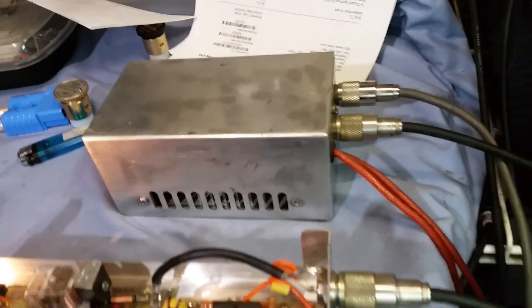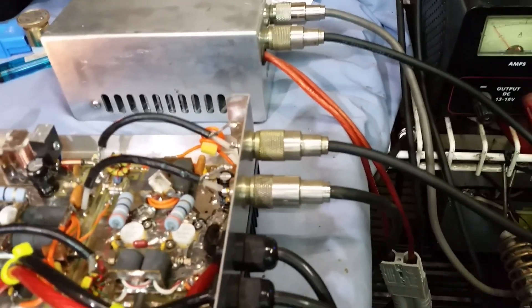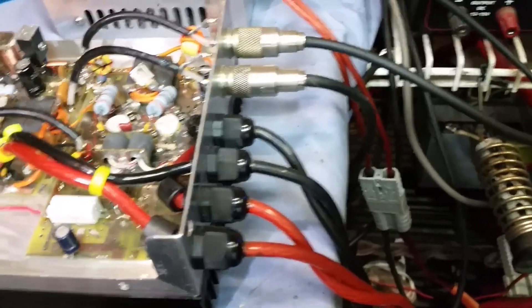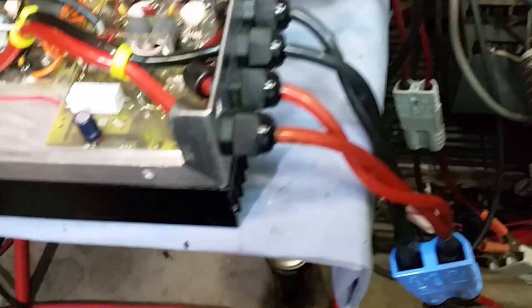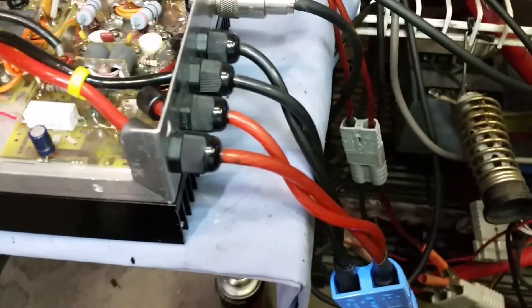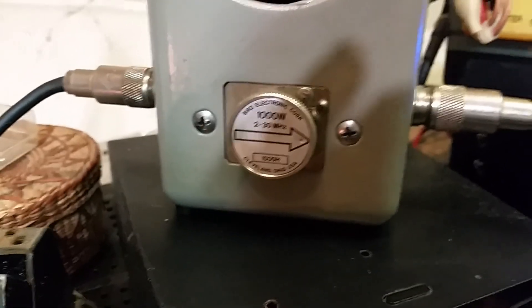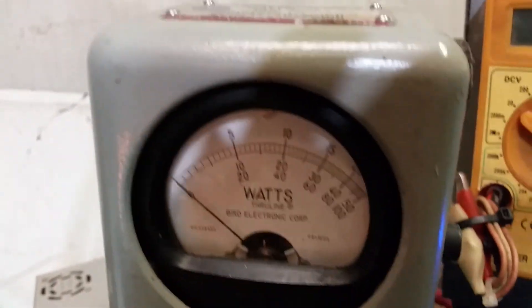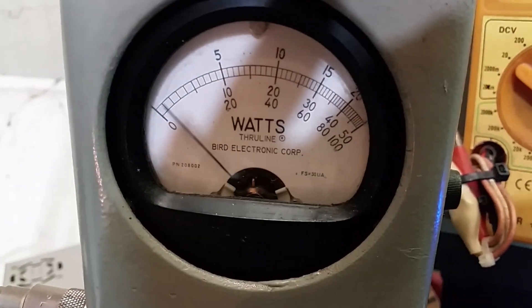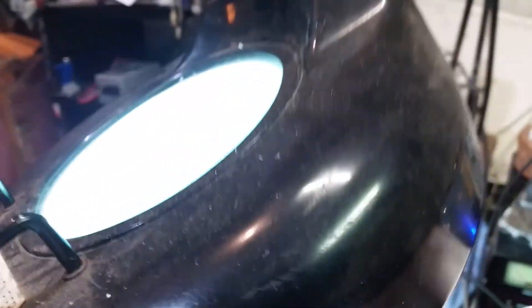Because of that I went ahead and hooked up the old one-pill driver, just so you can see what it's doing with a one-pill driver hitting it. You can run this like this if you want — personally I like running Texas Star 500s with radios, but that's just my style. They are high drive but that's my preference. I've still got it on the medium tap, dropping into the 13-point-something volt range. Thousand-watt slug in — right there at 400 Bird.